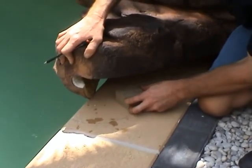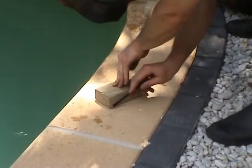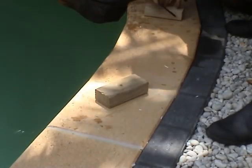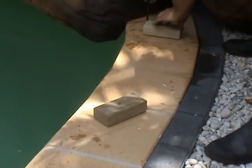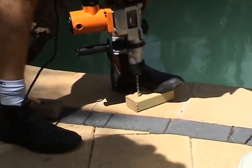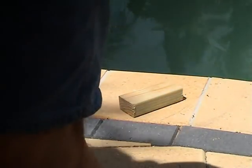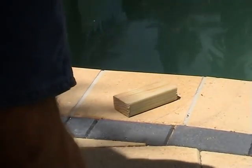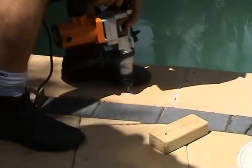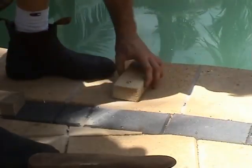Using suitable size blocks of wood, lift the rock and position blocks under and against internal rock edges. After determining block position, remove the rock and outline in preparation for fastening. To attach blocks to coping, pre-drill holes into timber and pool coping for insertion of bolts. Two to four blocks of wood may be needed per item to ensure a structural installation.